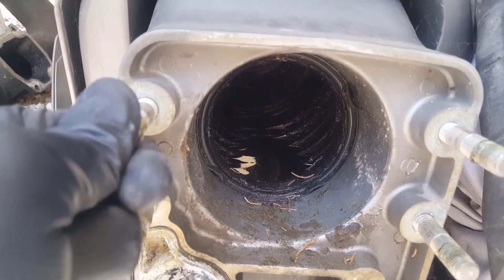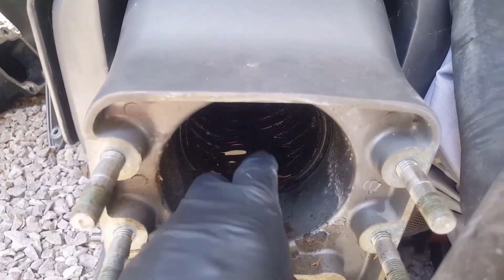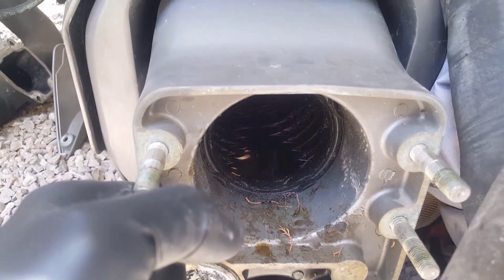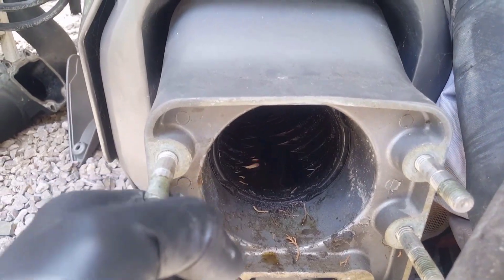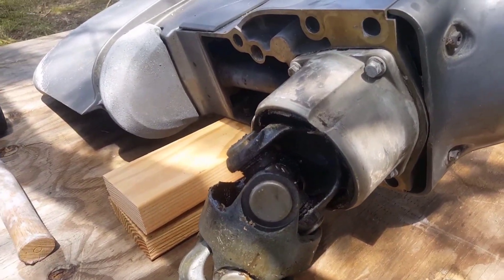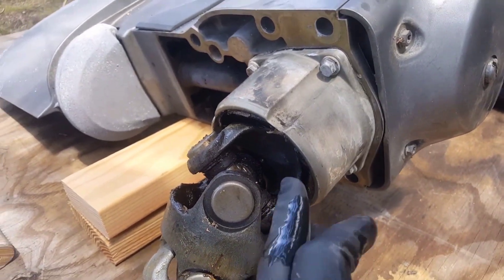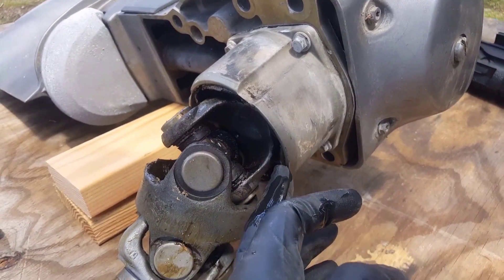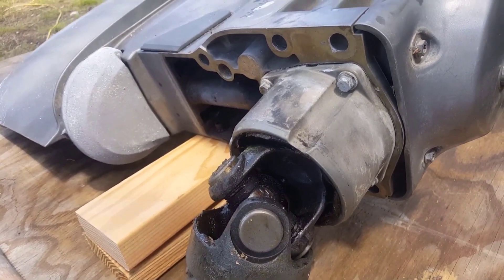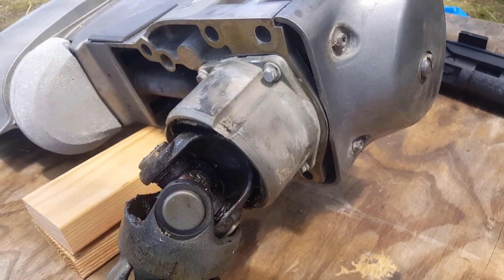This is the whole reason why we're even looking at the seal in the first place. Normally on some of the older Volvos or even the OMC Cobras you would see water in here, but this one actually has gear oil — crazy, right? Obviously the bellows are intact so that's a good sign. On the older OMC's when you had an oil seal leak in here you actually pretty much had to send it off to get it repaired, because there was no easy way — even though you took the bolts off — to get to the oil seal in the housing for the pinion, which meant more money. But with these Volvo Penta SX's you can actually remove the seal without having to send it off.